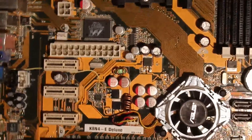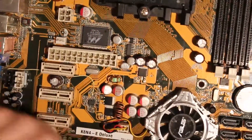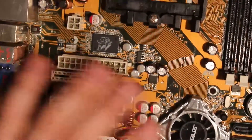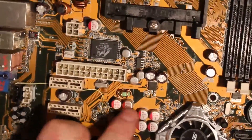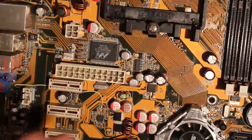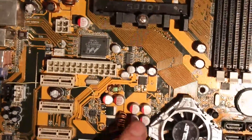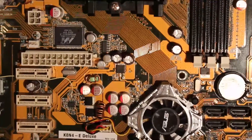Also the Northbridge chipset — Northbridge is technically the memory controller so it's in the CPU chipset here. nForce 4. There is no switching frequency mod or anything here, it's just aluminum polymer caps, so I replaced input filtering with some salvaged 560 microfarad caps. I also get around 10 millivolts ripple here. Those are new FP caps on the output filtering. Those carry this whole thing quite a bit.